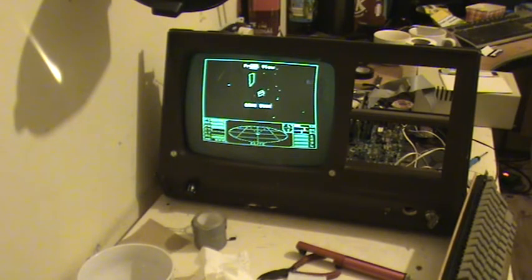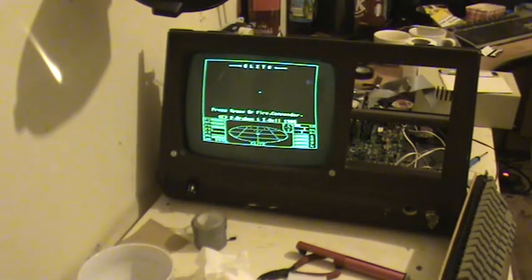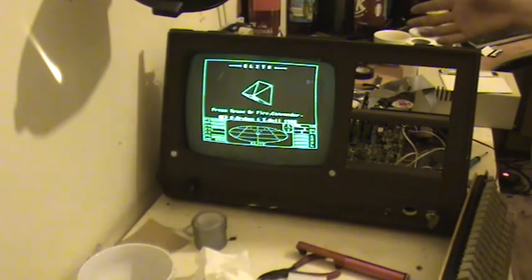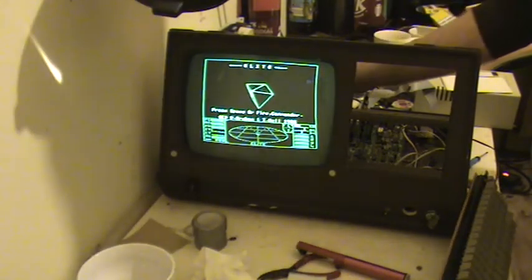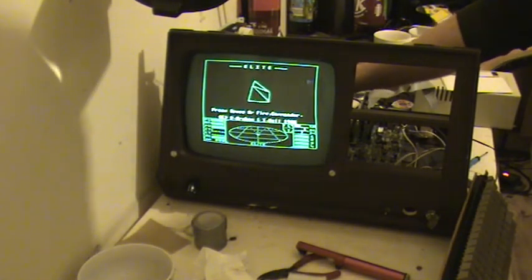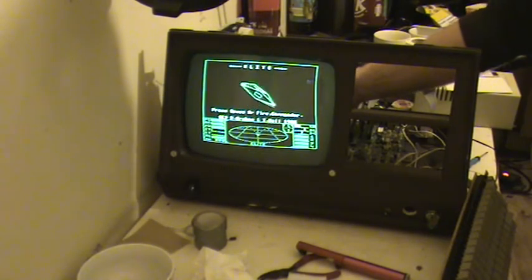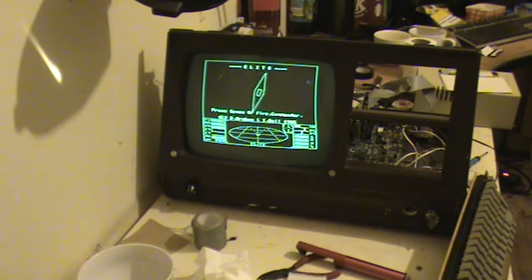Getting the odd flicker on the screen, I'm imagining the analog board has to be recapped. And the alignment here, there's 4 little controls on the yoke, I think it's called, in the back. I'm not sure how to adjust them. I've been trying while it's on and I'm pretty freaked out because there's high voltage in here, like, but that's what that one does. And, oh shit, I'm terrified to touch it. So that's where we're at with this machine, lads. But hey, it's not a bad start.